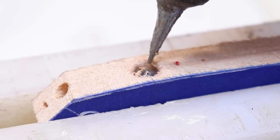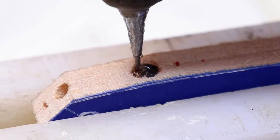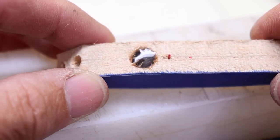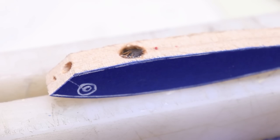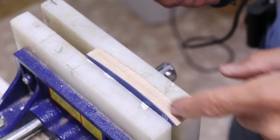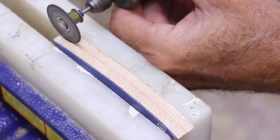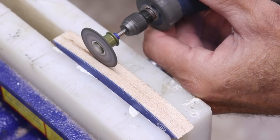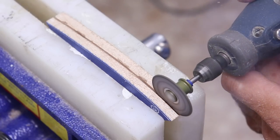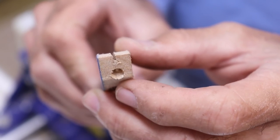We'll fill the hole with some UV resin. It'll need a little sanding later but it's nicely filled. Now let's go ahead and cut the slot — I'm going to cut it with a Dremel tool, but you can cut it really easily with a hacksaw blade; takes no time at all. We're going to go down about an eighth of an inch. That gives us a nice straight slot that terminates right where the wire is going to come out on both ends.